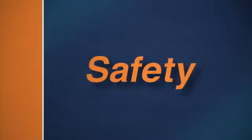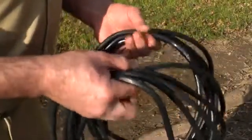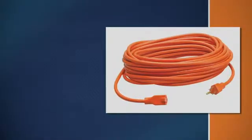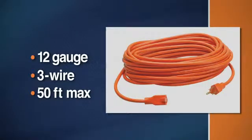Before you start, remember the following safety instructions. Be sure to wear safety goggles to protect your eyes from spray and debris. With electric models, check the power cord to make sure there are no cuts or frays, and make sure the grounding prong is attached. If the power cord supplied is not long enough, use a heavy-duty 12-gauge 3-wire cord in good condition, no more than 50 feet in length.